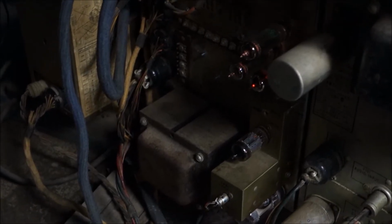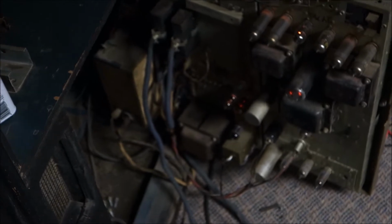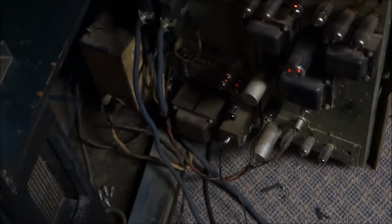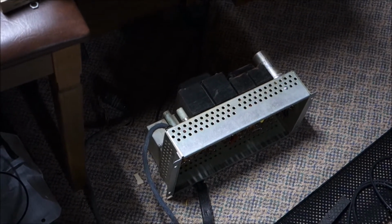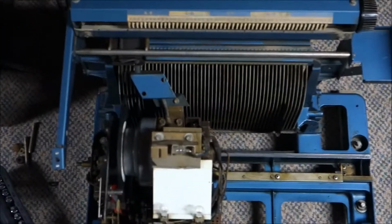So anyway, now the Tormat's working. What do I have to do besides put it back together? Well, this is an AY100, and right now the way it's hooked up, it is a Y100, meaning it only plays 45s. And quite frankly, I could live with that, but it does have that auto speed unit sitting right there, and it's already been recapped. Do I really want to deep dive into that and get that thing going so it can play 33s also? Yeah, maybe. But we'll take our small victory at this point.